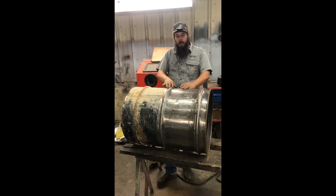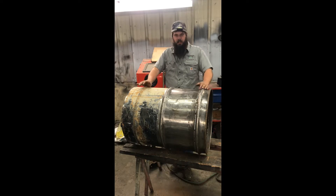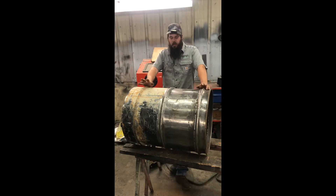I'm going to have to cut the hopper two pieces down and put them together. On my last truck it just wouldn't work out the way that I wanted to, and I ended up welding the top and bottom together into a single-piece hopper. This one I'm going to leave as a two-piece hopper because these systems are known for, in a couple of years, the top of the hopper getting a little bit thin because of the corrosive wood gas. So you want it to be replaceable easily if you can. This one will be a two-piece.